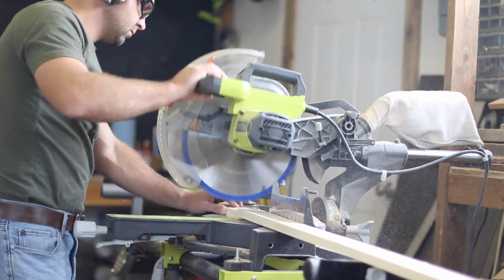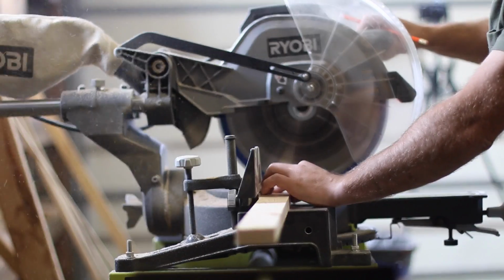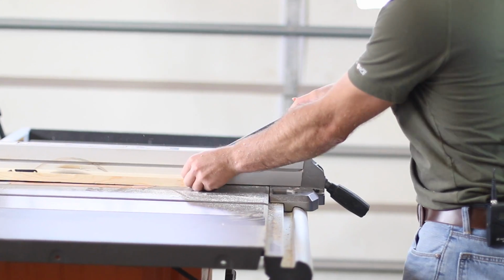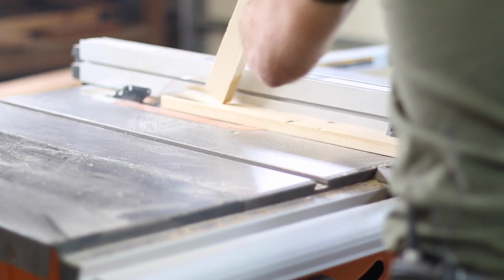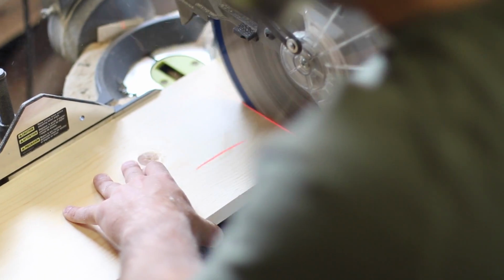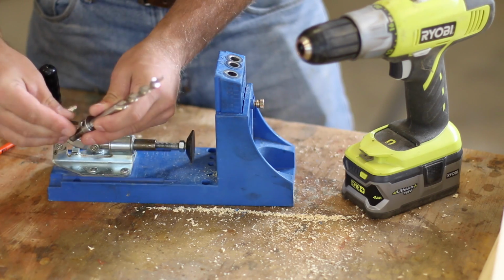The first step is to start making your cuts for the wood base according to the cut list on the plans at DIYpete.com/nightstand. Use a table saw to rip the legs and some of the other pieces down to size. Then use a miter saw to get the boards down to the correct length. Next, we'll assemble each of the legs.